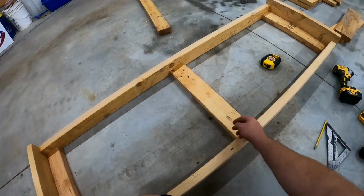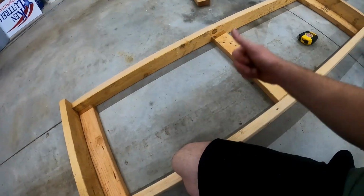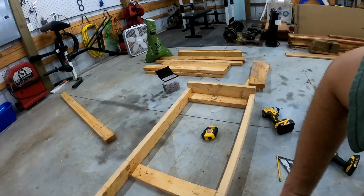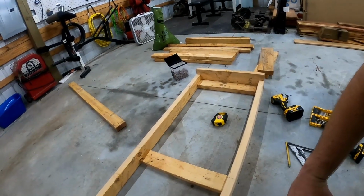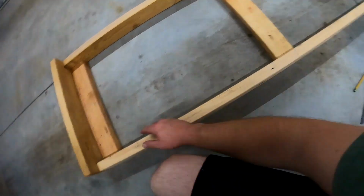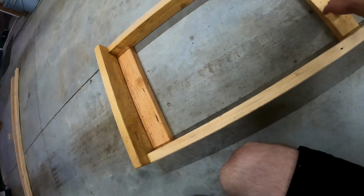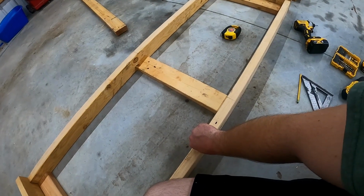What those are going to be for is to pocket hole some screws into that big topper, or that countertop over there. That's like the cheater's way of doing it, and we're just gonna snug them up there. But yep, that's it. So halfway point, edge, that should be plenty. Put three screws in each of these 2x4s to hold down that countertop.